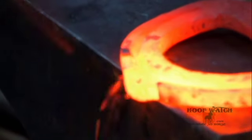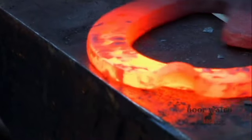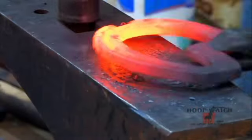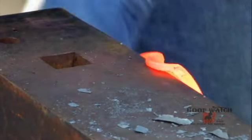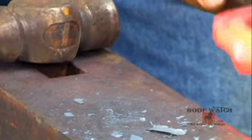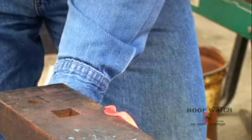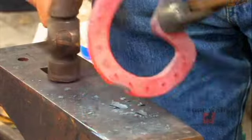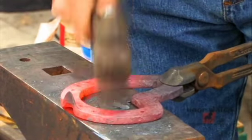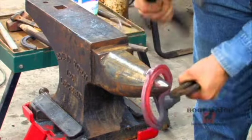Okay, just lower my shoe as I get my source material out for the clip. I level around it before I actually pull the clip. Come to the side, hammer straight down. Once I've established the width of my base, then I turn my hammer and still hammer straight down until I draw out the clip that I'm after. Now it's actually just a little bigger than probably needed for a horse like this. And then lay the clip down at the angle of the wall.